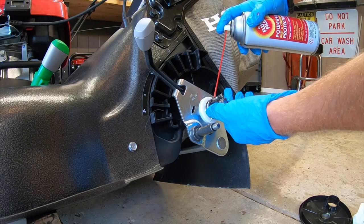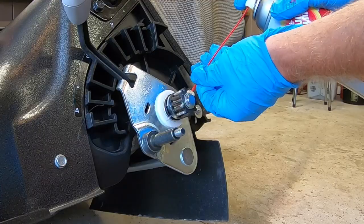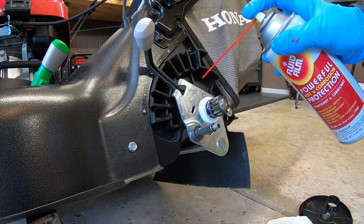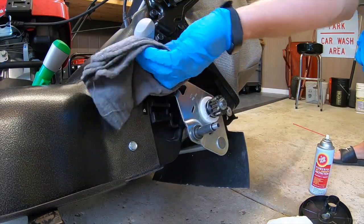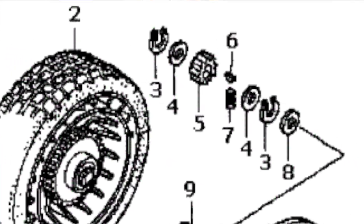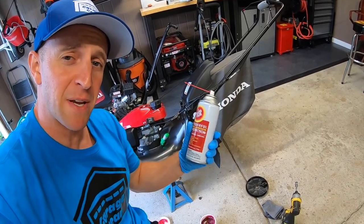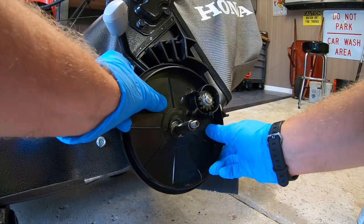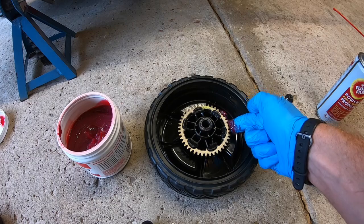Now here on the back side, what I'm going to do is pull this gear back just a little bit, spray some Fluid Film back there behind the gear, and then spin it around a little bit to work it in. Take the Fluid Film right here in the front and give that a quick shot as well — spin the gear and work it in. Then I'm going to take my Fluid Film, give all this a quick shot, and wipe this down to protect it. Then I'm going to coat the height adjuster. Inside these gears are some tiny little springs and keyways. Now if those rust up and seize together, the back wheels on this mower could possibly not move. So keeping those lubricated often will help keep this whole system moving and never seize up. I like using Fluid Film for these applications because it's a good penetrant and lubricant — it'll sink down into those tiny crevices and really get at those springs and keyways. Then I'm just going to slide my debris shield back on and grease up the wheel shaft.